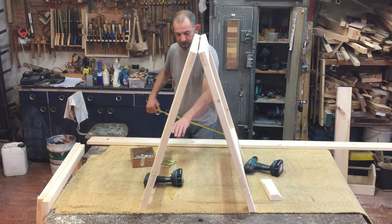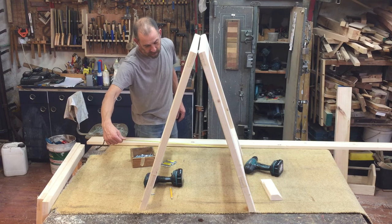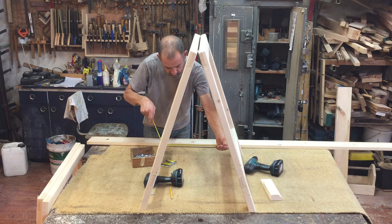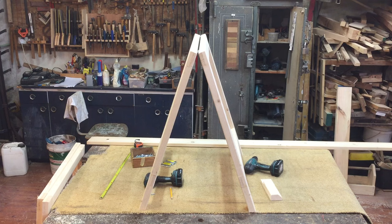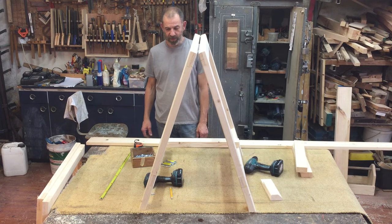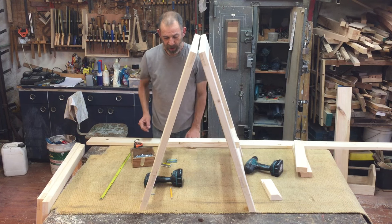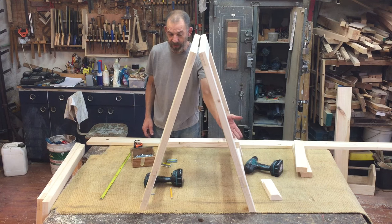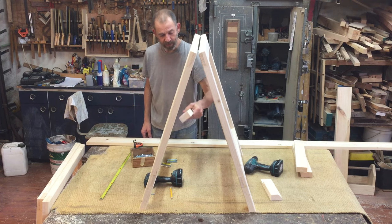Okay, 60. Now I need to know what's the distance between here and here — I've got 41, 40 and a half. So hopefully I have a few off cuts from before. Out of one of these I will get enough pieces, and then it's going to be hinge-hinge-hinge like this, but I've got to cut it not exactly in the middle but 20-20, and then put on those hinges. So I'm going to move over to the table saw and cut it.